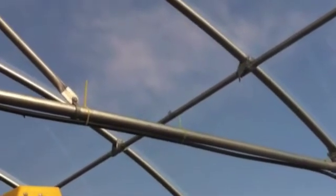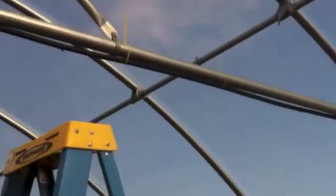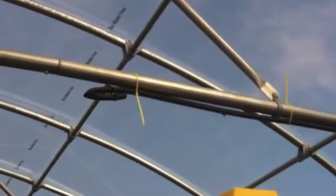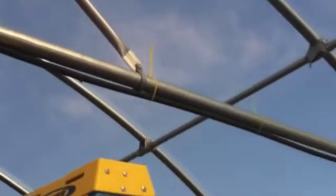On each rafter that has a rafter support, we're bringing up the overhead line from a tee off the ribbon board. It dead-ends up there — we just fold the tubing back on itself and tie it off, which makes a watertight seal. Then we put in two overhead sprinklers on each overhead line.